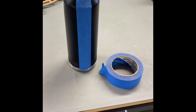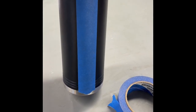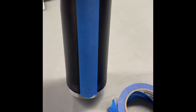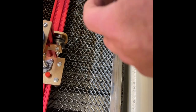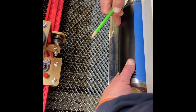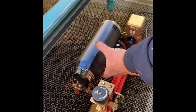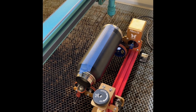Okay so we have our 32 ounce water bottle. What I've done is run a piece of blue painters tape down the front, down the length of it. I've already made one mark on it but I will show real quick how we make the next mark. I know that this bar is straight, so I can just put my water bottle there and run a pencil mark so that now I have a straight line. I can throw it right into my rotary - this is probably the easiest way to figure out if your rotary is in your bed straight.